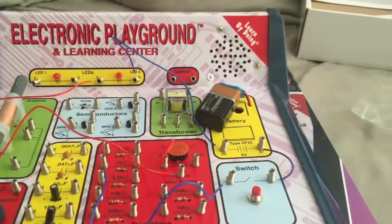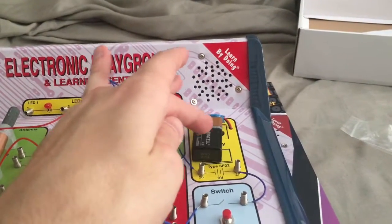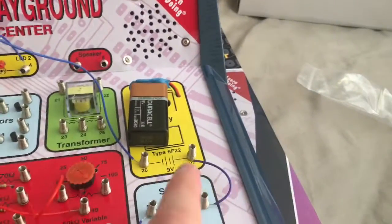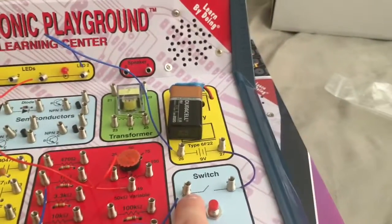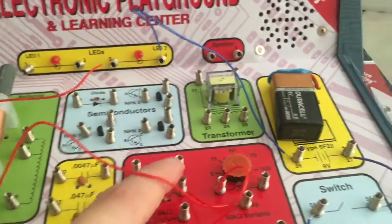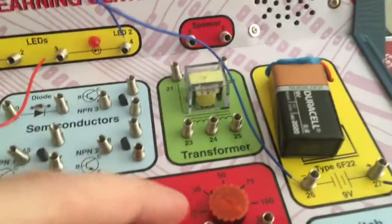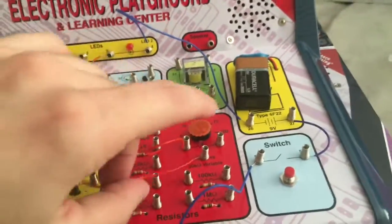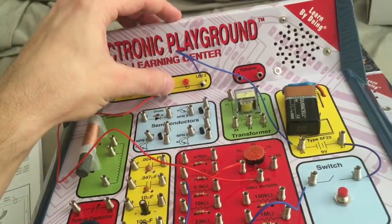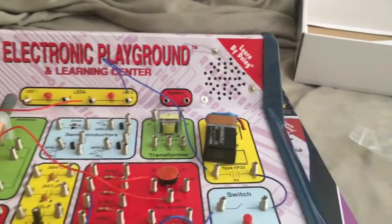Okay, so here's the wiring of experiment 2. We still have the battery plugged in from 26 to 56. We're going to go from the other side of the switch, from 55 to 40. And then you go from 41 and follow this wire straight over to 48. And then out of 49, you're going to post 3. And then post 4 goes to 26 right there.